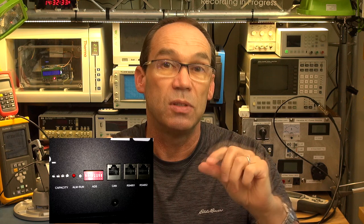Let me go through a little bit of explanation about how these packs go together, and particularly the addressing. These battery packs have two communication protocols. On each battery there are three RJ45 ports — the RJ45 is just the physical connection type, like an Ethernet or network cable — but here they're not talking Ethernet. The two protocols are RS485 and CAN bus.